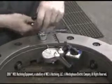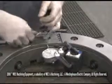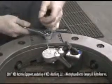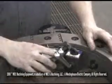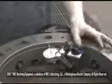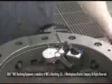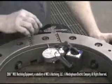Here you'll break the nut loose, snug it up where you feel the bearing touching on your V-groove, snug it back up. And right here we'll set our indicator at 0. Turn it 180 degrees. And right there we're dead on the money. Basically 1/1000 between nothing there.